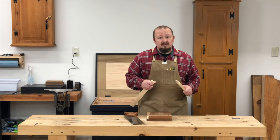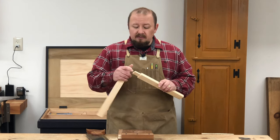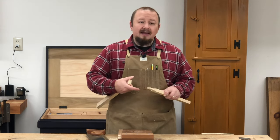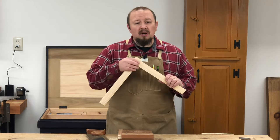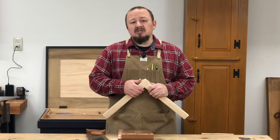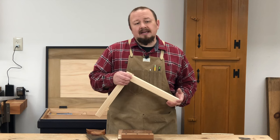You may fuss with it for an extra 10 or 15 minutes. If you're building a table, you're going to have at least eight tenons to deal with. If it takes you an extra 15 minutes to fuss with each one, you're looking at an extra two hours of work just to make those mortise and tenon joints. Whereas it may have taken you an extra five minutes just to chisel that little trough for the saw to ride in, and then that tenon fits the mortise perfectly right off the saw — avoiding all that extra fiddling. So when it comes to a first class saw cut, my opinion is it makes all the difference in the world. It's much more efficient and much more accurate to use that knife wall or trough to set your saw into, and you're going to find that your joinery will fit off the saw with much less fiddling much more often.